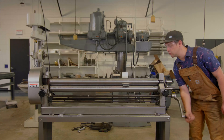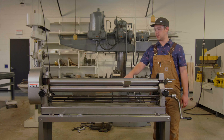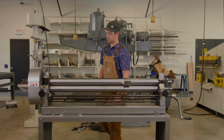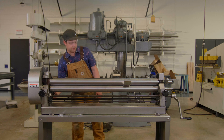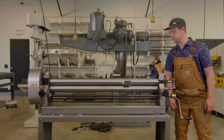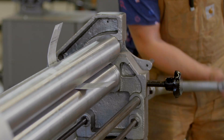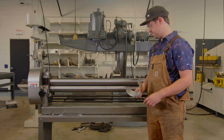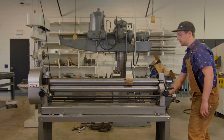If we want a steeper angle, we can bring it back through but not all the way — as long as some of the metal is still on this back roller — and we can tighten it to our desired angle or circumference. Making sure that both knobs are tightened evenly, we can continue to roll it and get our U-shape. If you need to keep going, you can just put it back in, roll a little more, and tighten it a bit more.